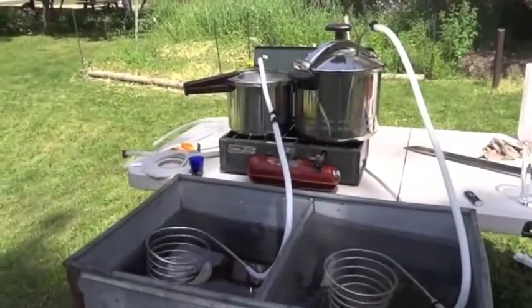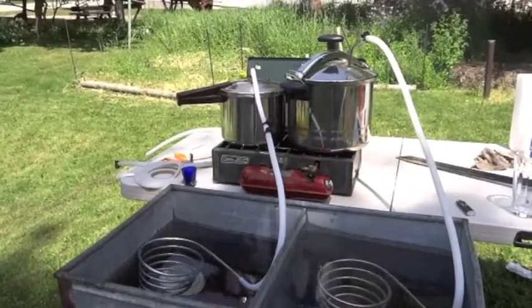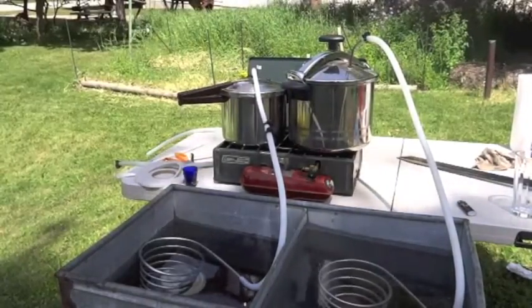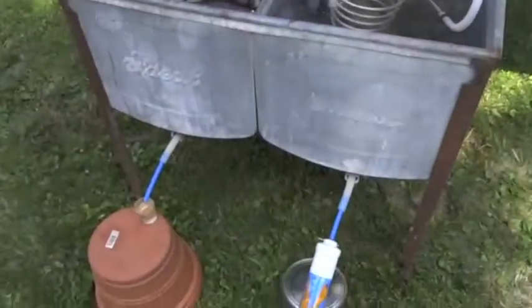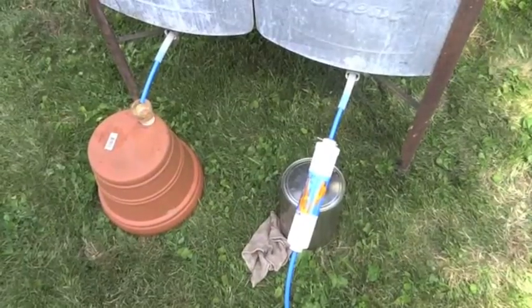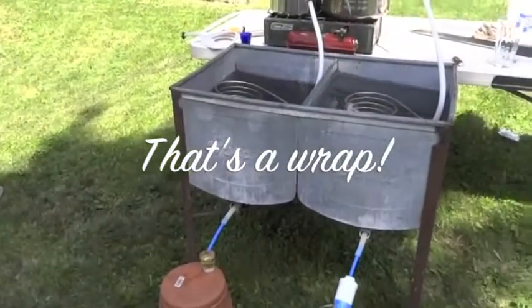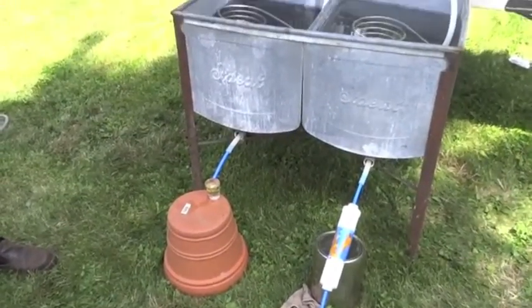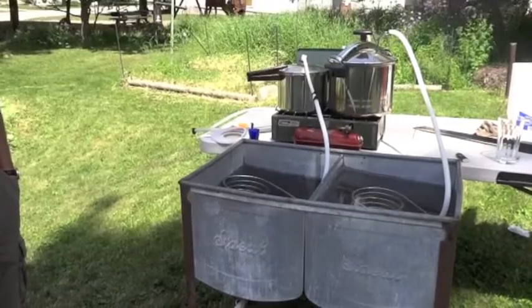We were just discussing how the water is still cool in the basin and that really facilitates the condensation. Once the water starts to warm up, you just want to replace it with colder water to maintain your flow rate. You don't want hot water passing through the post filter because that could affect the taste or the effectiveness. That's a wrap — we've got a great tasting end product from our Vortex distiller kit that distills ocean water into drinking water. Thanks for watching.